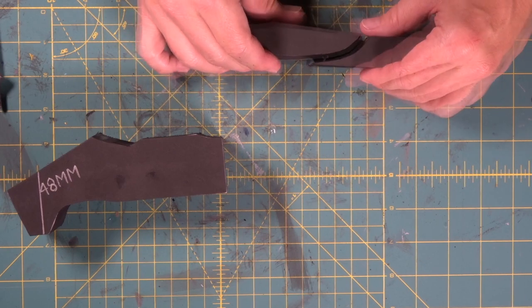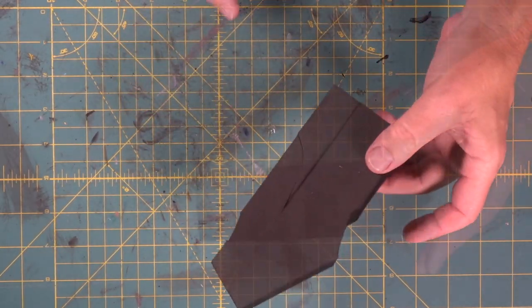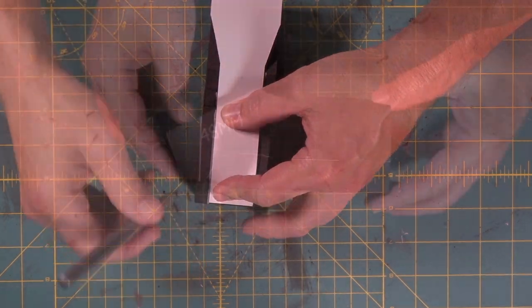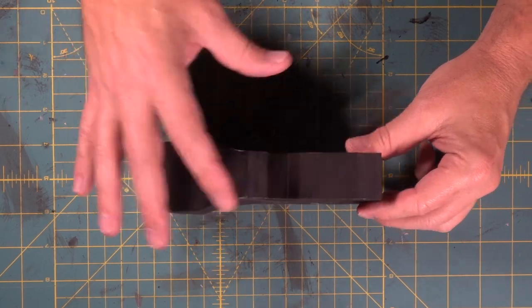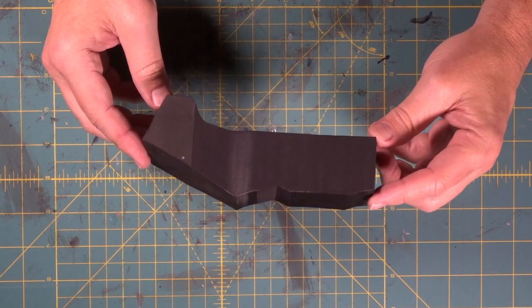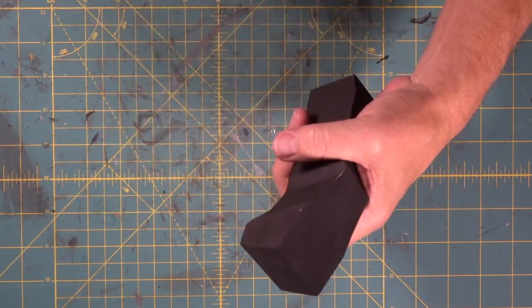We use double stick tape to stick the pieces together. Now we're going to come in with our second cut at the band saw. We did our side cut, kept our bottom pieces, attached them so we've got a flat bottom base to send it through the band saw. There is the rough shape for our handle — we did the side cut, kept our base, stuck it on, laid it flat, and sent it through for our taper cuts.